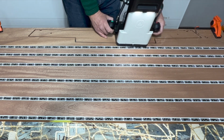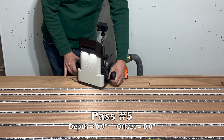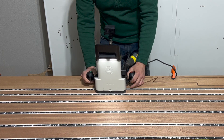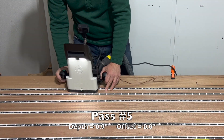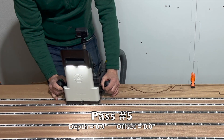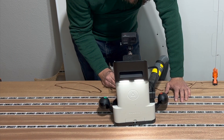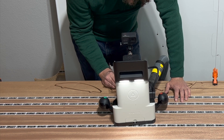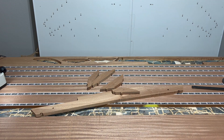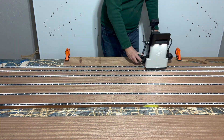With the completion of each frame component, I move down the board, reload the design, and cut the next frame part. Perhaps my biggest time savings was to write the part numbers on the boards with a pen. This simple change eliminated the need to change bits and redo the Z-touch after every part. And because I'm not cutting through any shaper tape, I can simply move the board down and start on my next cut.